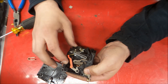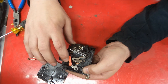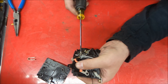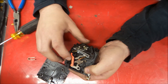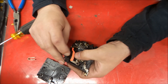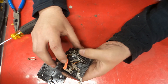I think I've got it now so it's not going to reset — it's doing exactly what it was when I opened it up. You can see that this tang is just not catching. When I adjust this out just a hair, it catches and we can reset the breaker. I don't know — I'm not a Square D rep — I would imagine this is not advisable to do these sorts of adjustments.